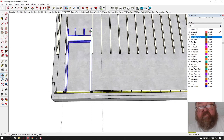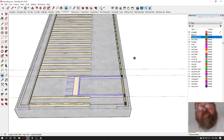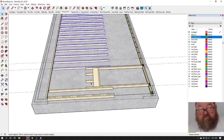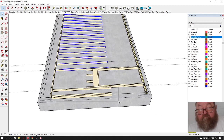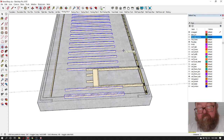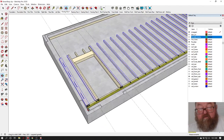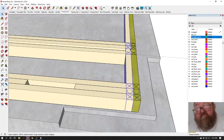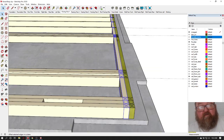And sometimes you'll wait till you've got your top plate across there. So then all the rest of this stuff, I'm just going to move the studs in and corners now. Put them in 5 feet. And then once you get all your components in there, normally if this was a wood floor and we had these two plates, we would leave this one here and take this one at the top, because then that one's already against the wall.